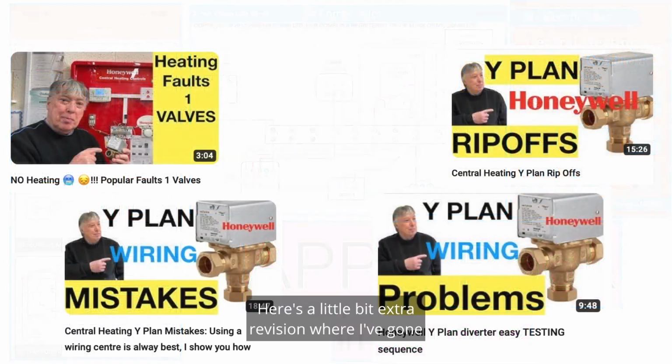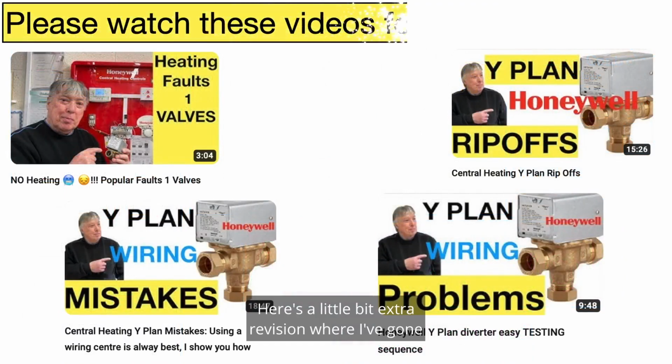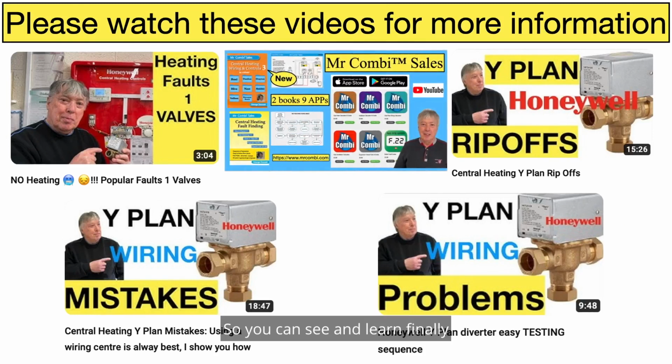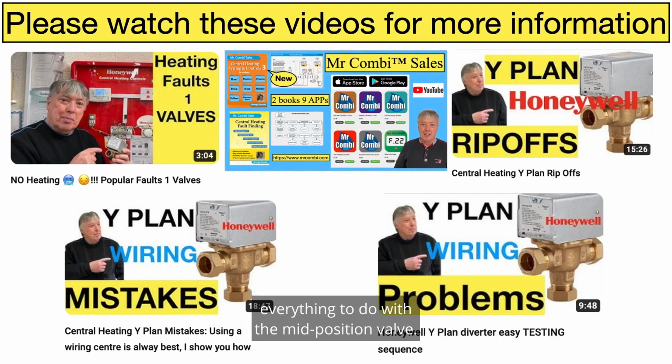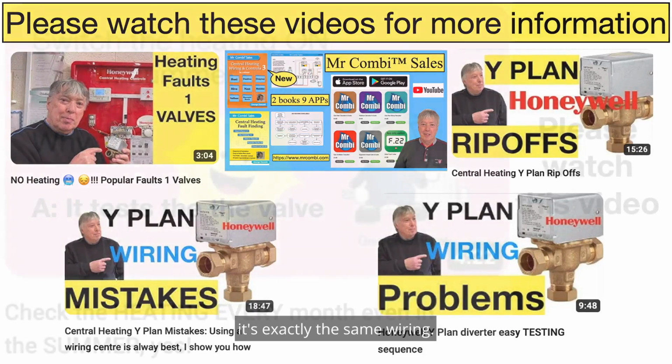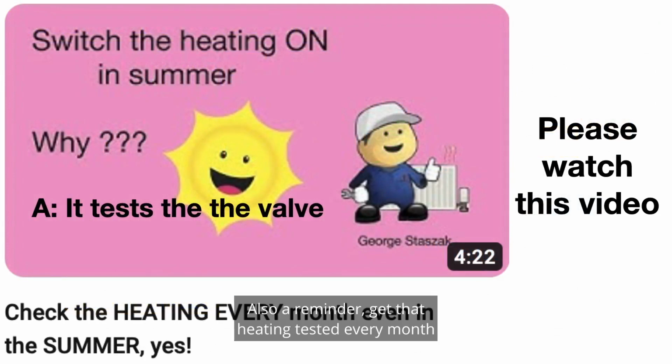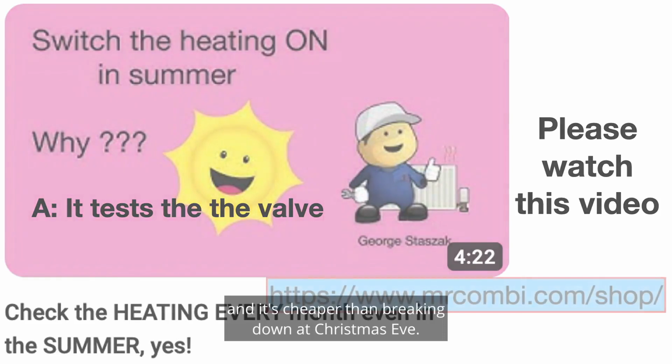Here's a little bit extra revision where I've gone into depths about the rip-offs or the problems, so you can see and learn finally everything to do with the mid-position valve. No matter who makes it, it will be exactly the same situation, it's exactly the same wiring. Also a reminder, get that heating tested every month for 3 to 5 minutes to make sure that the valves move and the heating works correctly. It's good for the system and it's cheaper than breaking down at Christmas Eve.